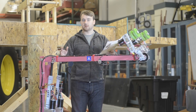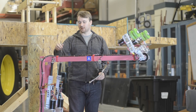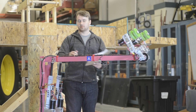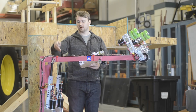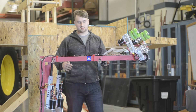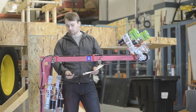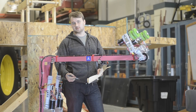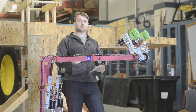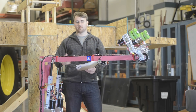At a worst-case scenario, when the angles are disadvantageous for the actuators, it comes out to about 270 pounds of force pushing down. We originally thought we might be able to get by with one dart actuator to hoist this whole thing up and down, but being able to only provide about 204 pounds of force each, we quickly realized after doing some math that we would definitely need two dart actuators to manage this.